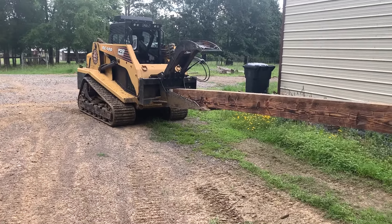All right, we've got it down here at the cabin. We've got it up in the Jigamaroo — kind of halfway balanced. I've got to make a little allowance for it. You can see the ice tongs and this load leveler that I rigged up for setting these longer beams. So all I've got to do is turn the crank handle up here to balance this load out. I didn't really get a good connection right here — it should have been down lower — but I can still balance the load out, and it's got a good firm grip on it. You have to pry them out of there just about.